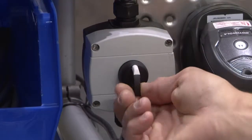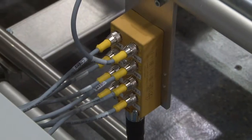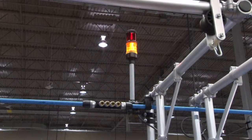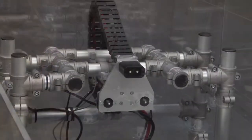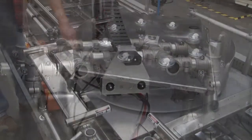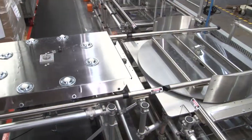The turnkey approach of our design involved modular pneumatic, electrical, and signal capability which yielded minimum effort connection. In addition to inline high pot and functional test stations, we accommodated offline rework and retest with a turnstile and a rework cart.